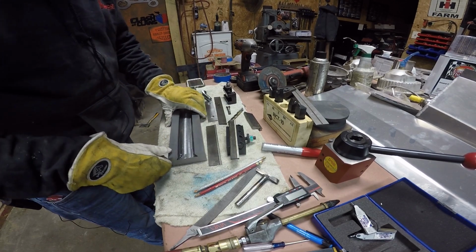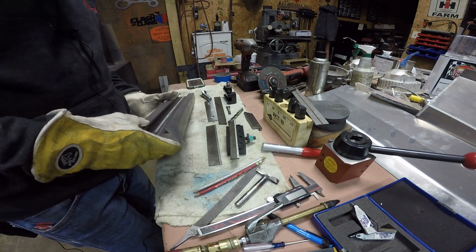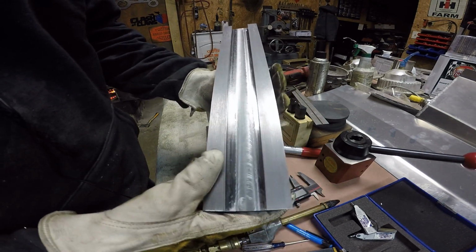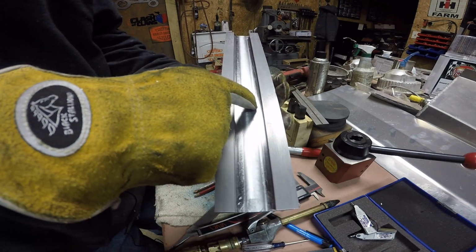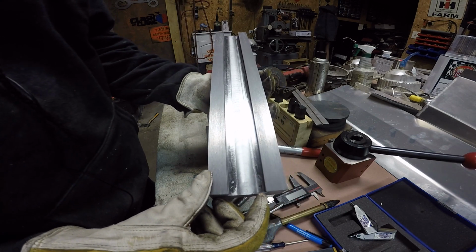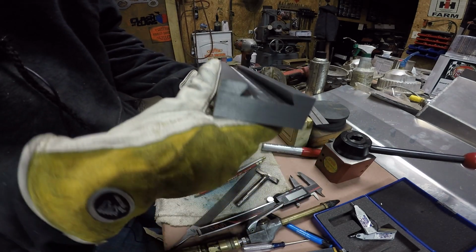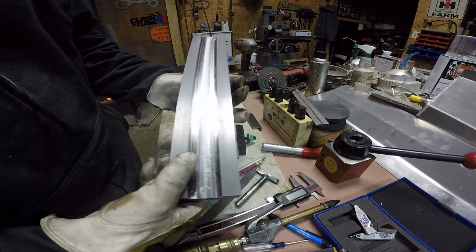Yeah, that dovetail turned out pretty decent. Let me see, I got the offset for the sides, and it's about 10 thousandths step in there. It's a little wider. Usually they don't come out much more than the dovetail, but it's just the way this one worked out. Nice sharp points, and it looks really good.